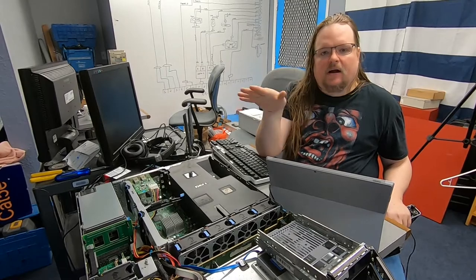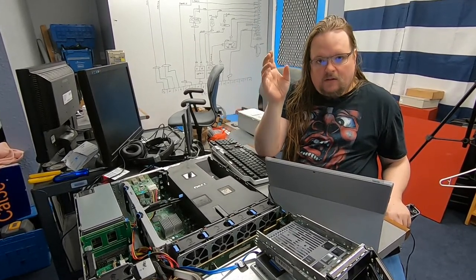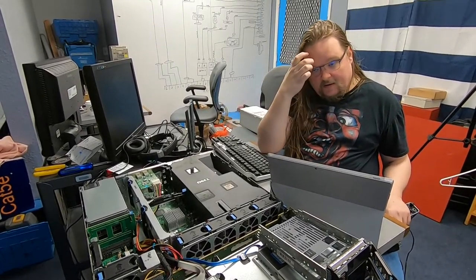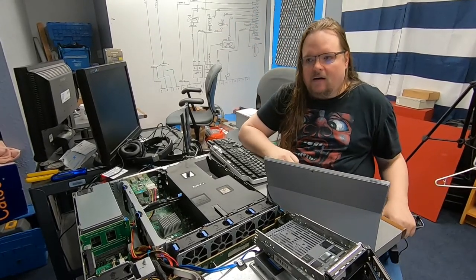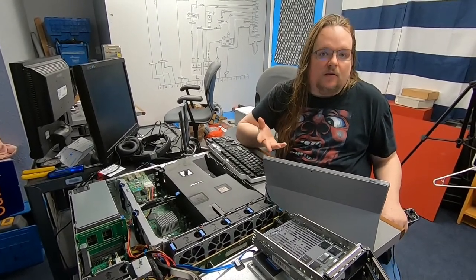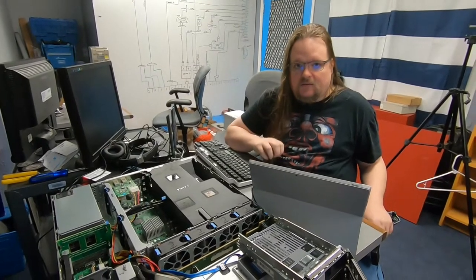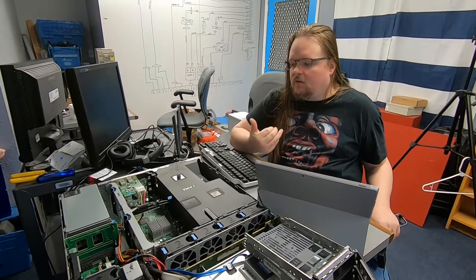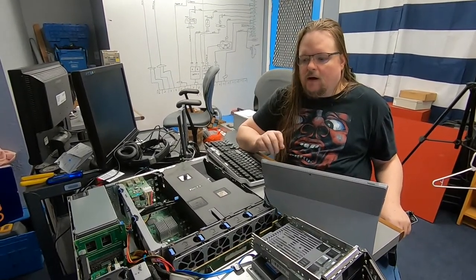There's like a buffer problem or some sort of weird communications problem with a USB sound card, the kernel will spam a bunch of retire capture URB warnings with like 10,000 messages dropped because it doesn't want to fill up your kernel logs, except they don't tell you what the messages were, so you have no idea what's wrong. But in this case, it was pretty clear that it was some sort of communications issue, possibly a buffer underrun between the sound card and the USB bus. So I did some doofing around.